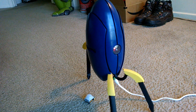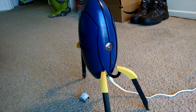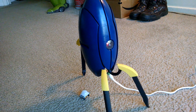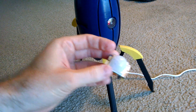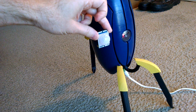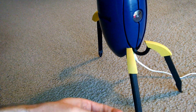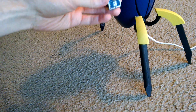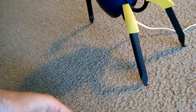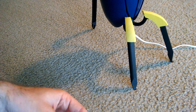In the eye there is also a light sensor, and that I'll use as a segue into design compromises that I made. A proper way to do motion detection is using one of these infrared motion detection sensors, however it looks nothing like the eye of the turret is supposed to, and it's pretty large. If I was to integrate the sensor even without its lens — let's pop the lens off and see — it's far too large to fit inside and still have the turret look correct, so I chose not to use that kind of sensor in spite of the fact that it would give it much greater functionality.